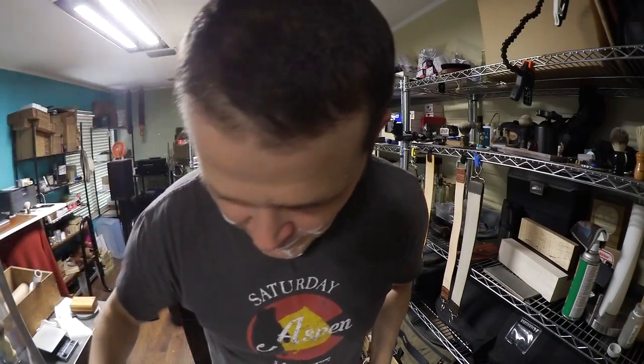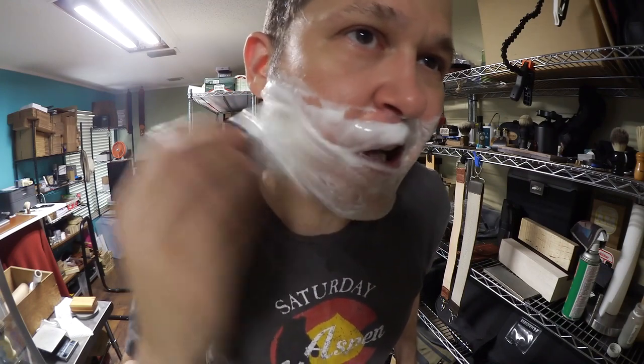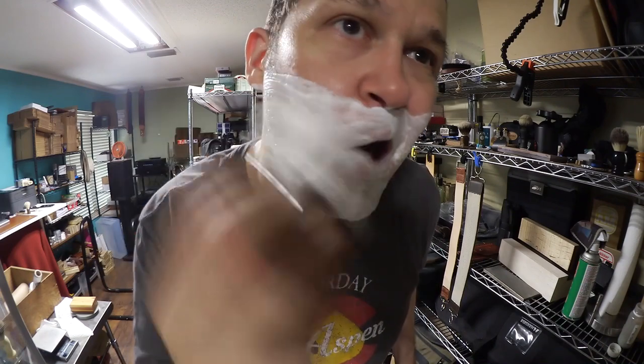I shall be most curious to see if on Monday, after I strop this razor after it sits around for 3 days, those problem areas where it is willing to chip away, because that pitting is right behind the cutting edge bevel, did they grow? And I would wonder, could you use a pasted strop on a concave surface, thus intentionally thickening the very tip of the cutting edge enough?